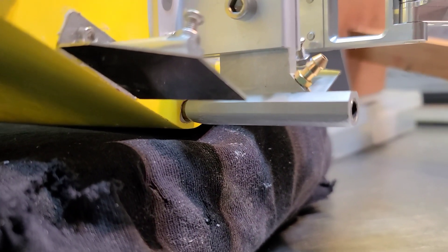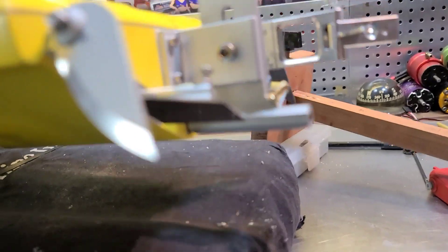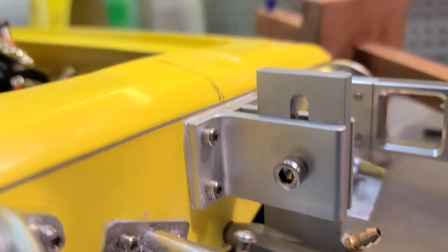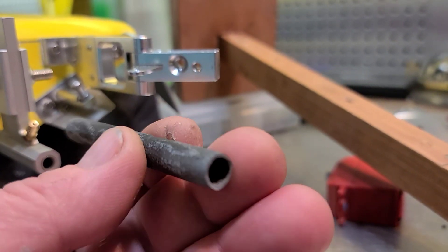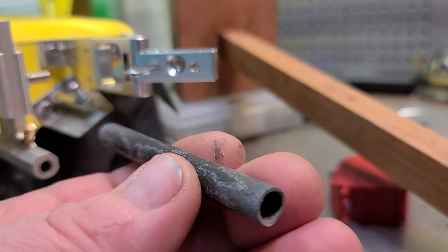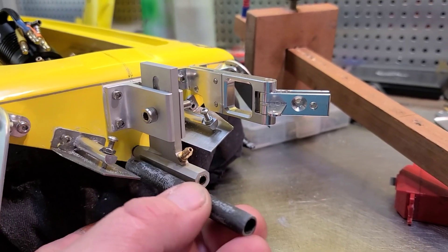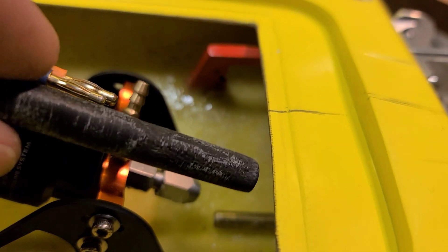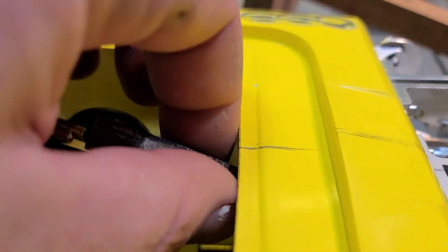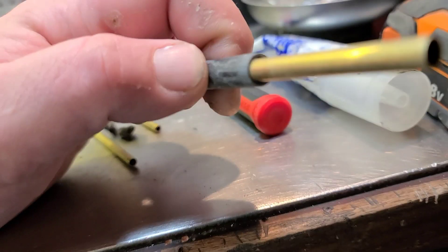I went up about 3 or 4 millimeters with my stuffing tube so it doesn't ride too dry and it doesn't ride too wet — trying to split the difference. I'm really still thinking about making a flooded stuffing tube so I can actually move my strut up and down on the transom. It would only be a few millimeters but that helps. You would be able to move it up and down, getting about 4 or 5 millimeters of up and down travel without messing with the angle of your strut.